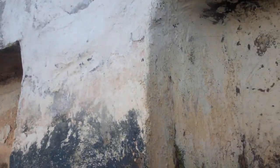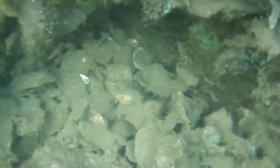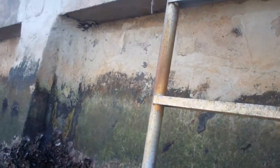This is a relatively large tide line right now — not low low, but close to low. This is the first piling on the border of the next property, and you can see some concrete work was done. It doesn't look like the bottom of the radius was done — the radius is completely gone. This panel has longitudinal cracks that were attempted to be repaired, but material was just applied on top without opening it up. You can see there's a diagonal crack too, and there are cracks throughout the panel.